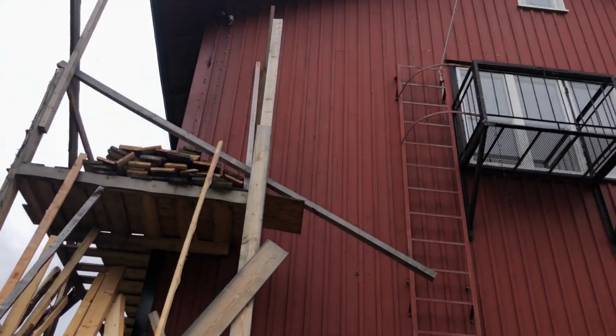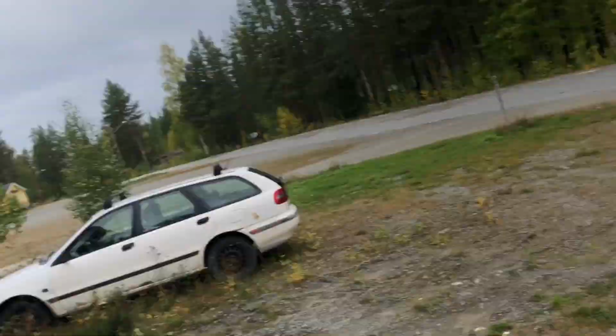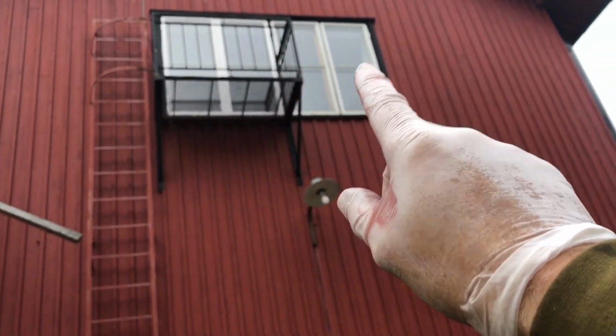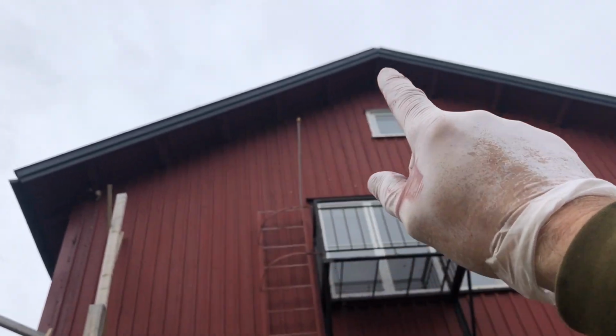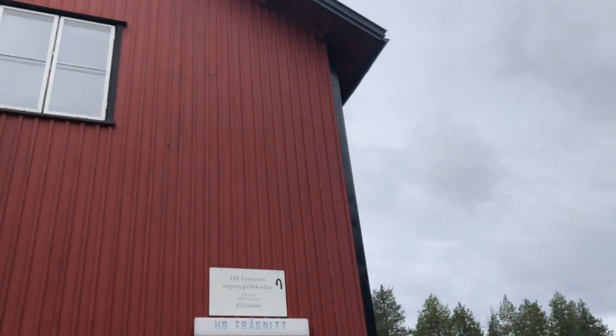However, the skylift costs money, and I have repairs to do off this elevation here. So whilst the soffits look nice, that's because when the Sky Lift was here, they were so bad I whipped up there and painted them a coat of some nasty black stuff, but that's not true. So these two windows here, it's easy to get out because we can get out from the fire escape. These ones are too big and heavy and unsafe for me to do from a ladder. In addition to that, under each one of the purlins that comes out, there's woodpecker holes and the boards need replacing. And the same on this side.